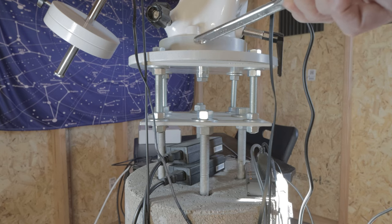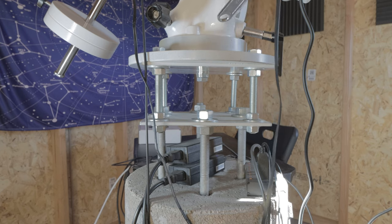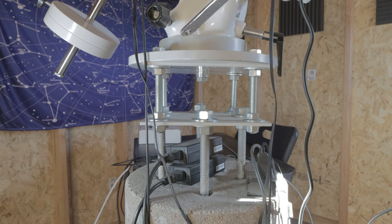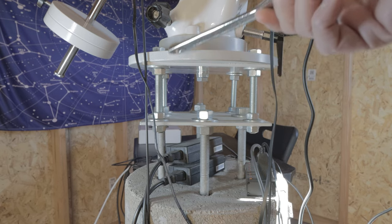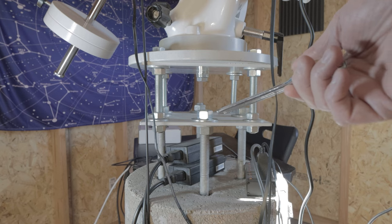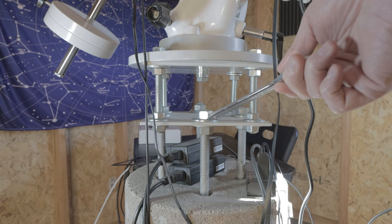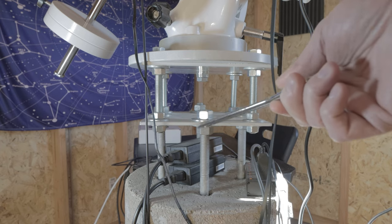The mount bracket is a repurposed 2012 Chevy Malibu rear drum brake — I found this on the internet and the hole in the center is perfect for the EQ6-R. For the polar alignment bolt I needed to drill a hole and used a five-sixteenths inch bolt for that. To drill through the steel plates and drum you need a titanium bit; I couldn't find one in five-eighths inch so I used a carbide drill bit with a lot of oil, and it took a long time just to get through three-sixteenths of an inch.